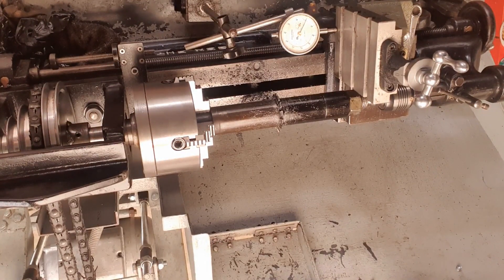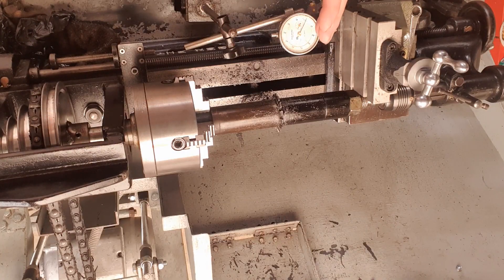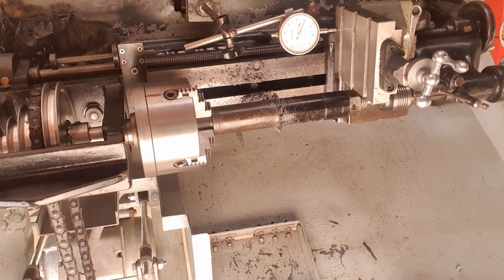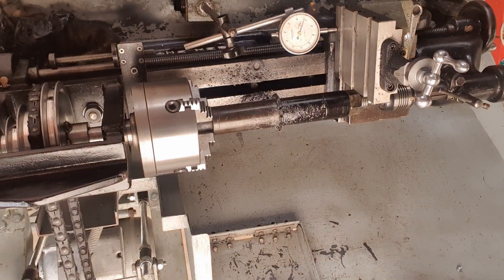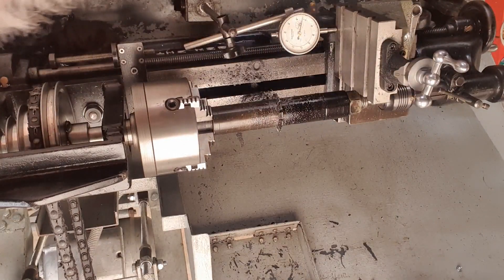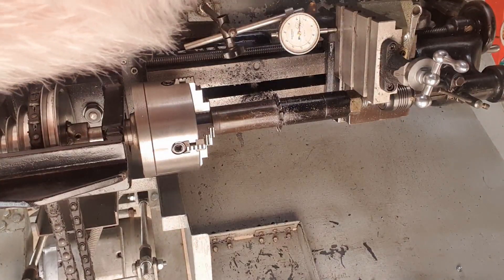Okay, finished the gear, cleaned it up, put it on the gear train for the first time. Set the gears up, set the dial indicator up to zero, and engage the feed screw, which is up the other end of the machine, not on the apron here. We'll see how far it will travel on here after one turn. The dial indicator is in thousandths of an inch. We're off. We're halfway — we've got three and a half there, so we know it's going to be seven.